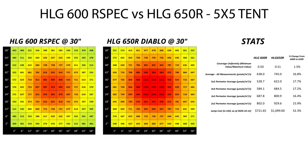You'll see I've done a few calculations on the right. The first is calculating coverage uniformity, or how evenly the light is spread across the space. This just takes the minimum reading for each height and divides it by the maximum reading for that height, giving you a number between 0 and 1. If every reading was exactly the same across the whole space, the uniformity score would be a perfect 1.0. Since these lights have identical footprints, their uniformity scores are pretty much the same.